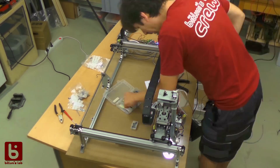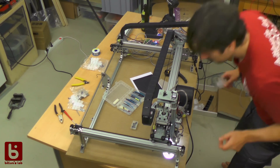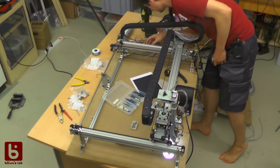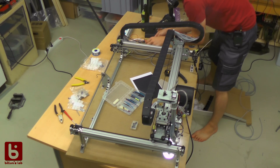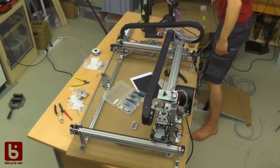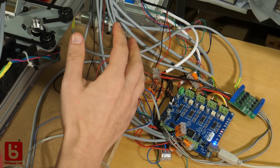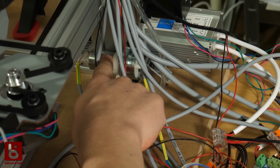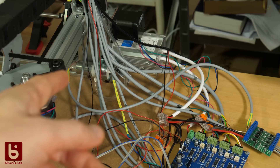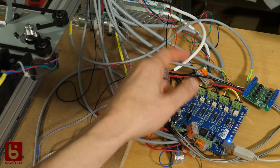And this is what happened — I released the magic smoke. Something smells here. Oh no, oh no — something's smelling, the board doesn't come on. Time for debugging. Still during the stream we were able to identify what was broken and what the cause was. The last thing I did before that happened was connect the pump. You're supposed to use the MOSFETs that were included to control the pump and the valve of the vacuum system, but I wanted to check the polarity of the motor and connected it directly to the controller board — and that was a huge mistake.